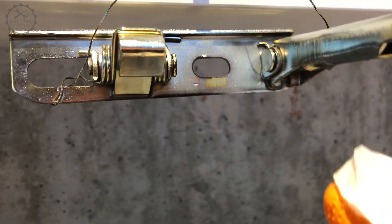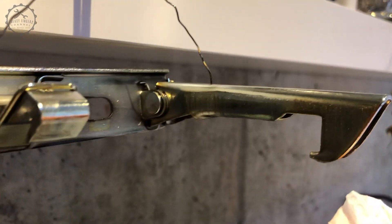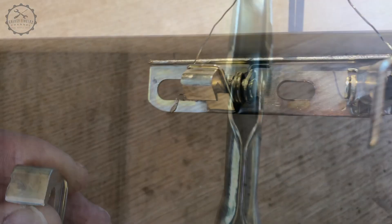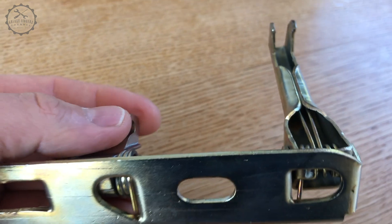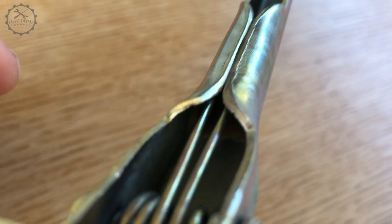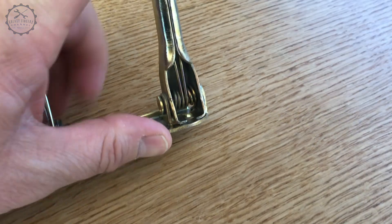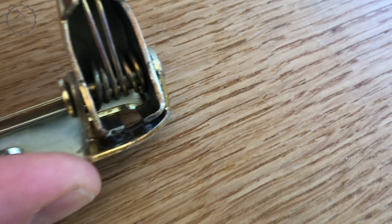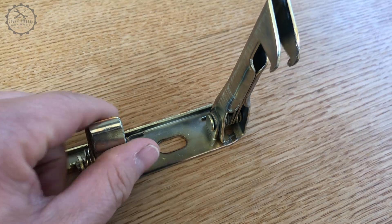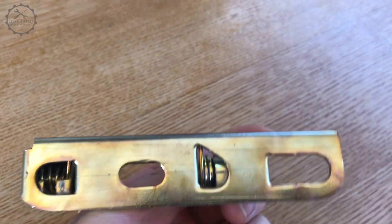Since the nested structure of the assembly keeps liquids from dripping off quickly, I avoid drip marks by soaking them up with tissue. I sometimes also air dry parts to avoid drip marks — but honestly, those rainbow-colored drip marks, I kind of like them. It helps a lot to move the assembly around while it's being coated, but there are limitations like long thin cavities and surfaces in direct contact. I can live with some uncoated areas, because the part is going to receive grease anyway, which will provide the rest of the required rust protection.